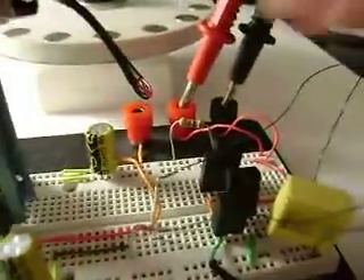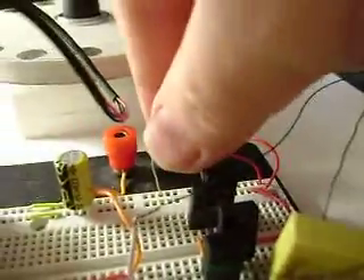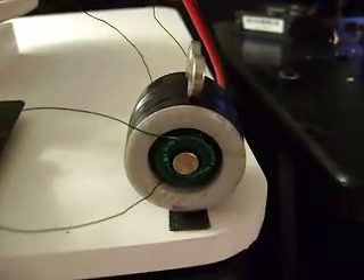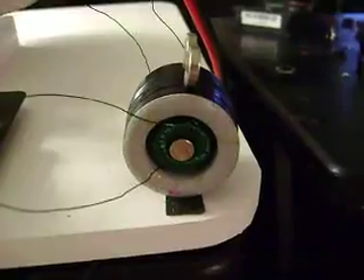Along with that, I also have this 100-ohm resistor — let me take that off. Our voltage is up to 5 volts with the fan running. She's running at about 3 kilohertz. I'm about to step her up and down to 15 and 6,000 around those areas and see how it does. This is the pulse we're getting on the output coil right now.